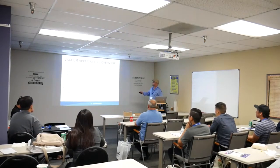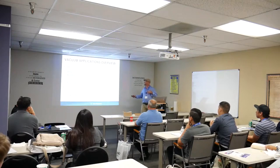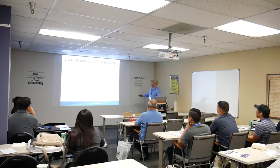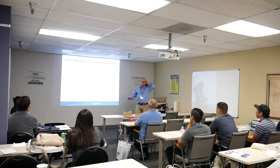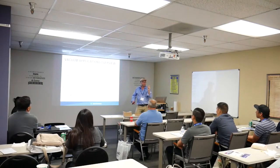Today we'll cover: what is vacuum, why is vacuum needed, some applications, levels of vacuum, types of pumps, and the spectrometer tube — the heart of the leak detector that determines how big a leak is. A hair is about an e to the minus five leak rate. We can go a million times smaller than one blade of hair.